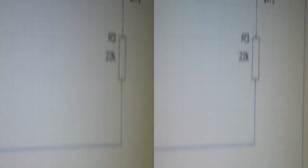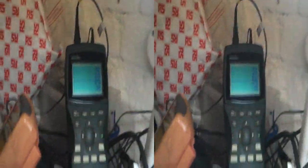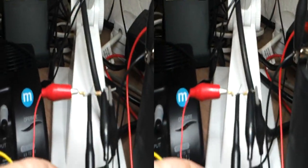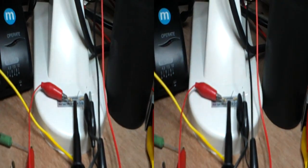And the 2K, which is one of those, and it's just basically to stabilize the voltage. And I've got my scope — this scope only goes up to about 100 volts, so I've had to put a potential divider in there. So the voltages shown on the scope are going to be a tenth of what they really are, simply because of the limitations of that. It's a 1 meg with 100K potential divider.